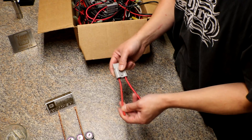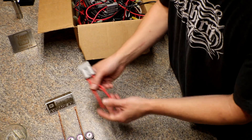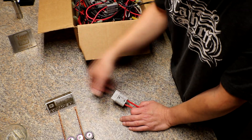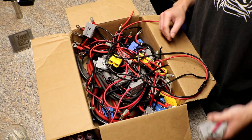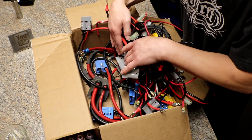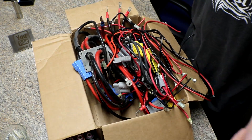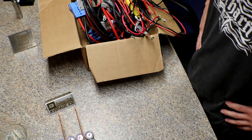At least one of the backup units over there has double wires inside. What I'll probably end up doing is using the 10 gauge between each pack and then 6 gauge on the very end — but I'll probably just make them all 6 gauge because I've got enough to do it. I've got a whole box full of these Anderson connectors, and there are some at the bottom with bigger connections I could use elsewhere.